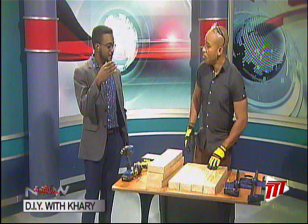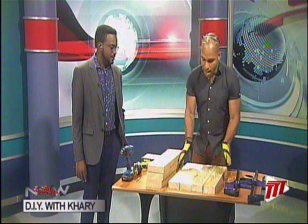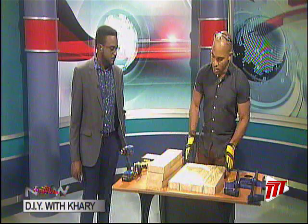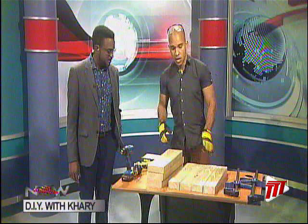We are actually going to do three shelves here - three layered shelves. You're using your real estate up. I have done what we call countersink holes; that's where your screw heads go in. Then you could cover that over with putty, so when you sand it, it looks smooth. So we had some pre-planning happening here. We're going to drill some pilot holes and then drive in some screws.